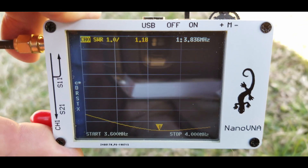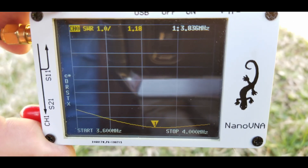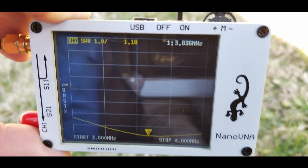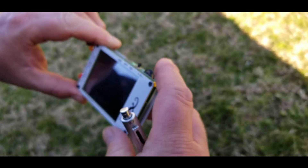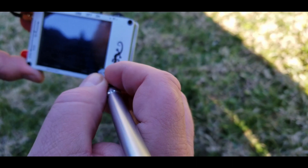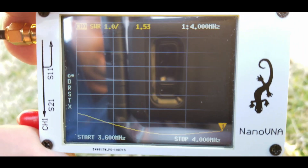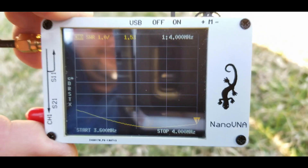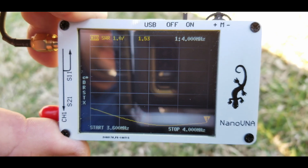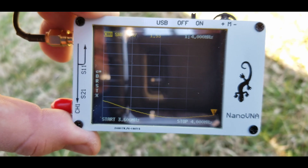Now we're down pretty close to the bottom — we're at 3.836 MHz on 80 meters. What are we looking at there, Chris? 1.18. We need to take it down and fine-tune it some more? I think we're going to have to mess with it another 3 or 4 hours — yeah, at least 3 or 4 hours. Let's go to the other side of the band, the upper side for Generals — it's pretty flat over there on the right-hand side. At 4 MHz it's 1.53. Is that even usable? I guess we'll have to live with that. So that was 80 meters using the Nano VNA. For full transparency, we already tested this with the MFJ as we were doing our field test, but we wanted to get the Nano VNA out to show you basically the same numbers. Let's set it up for 40 meters and see what we get.